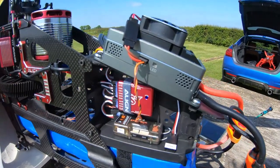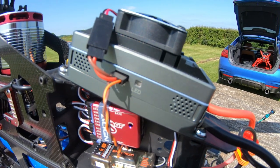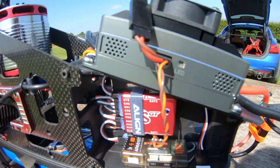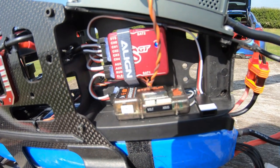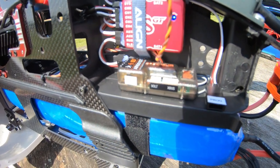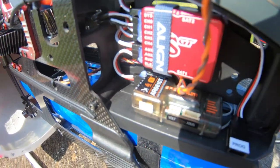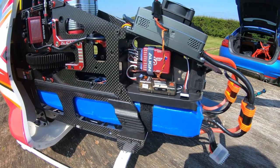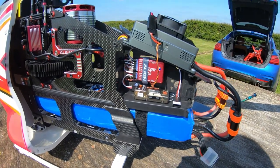What we've got here is the ESC has an output port. I've run the fan power from the plus and minus, and then the P for programming is also telemetry out. I've then run that down into SAT 1 on the Spirit GT unit. The Spirit GT just talks to the receiver via SRXL2 - just three wires, nice and simple. It's a bit of a wasted receiver but I wanted that capability of all the telemetry.